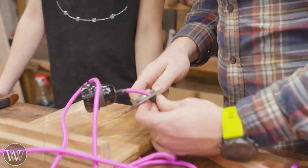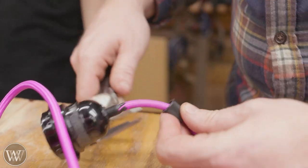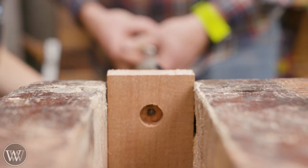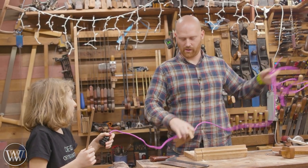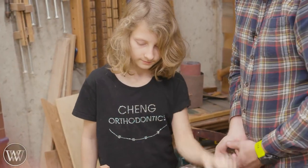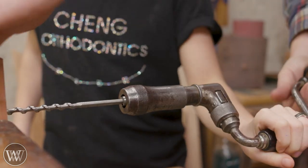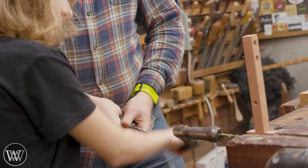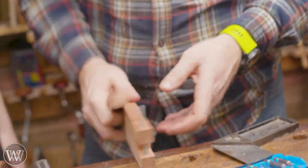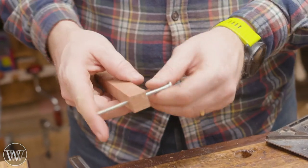You can see on this one we split a little — it's not as much of an issue here because we're going to be putting the pins through it and we'd like a little bit of force on there. We can ream those out and get them to the size we want. Speaking of pins, I have a little bit of three-eighths dowel on stock, so we're going to use that. The cord kit we came with — the cord can fit through, but the nut needs to screw onto the head, and there isn't enough threading on the head for the nut to come through. So we're going to drill a large hole for the nut to fit in, then a smaller hole for the head to fit in. You always drill the large hole first and the small hole second. We're also going to drill holes through the arm and through the vertical for the cord to go through, because we're actually going to have the cord weave through this whole structure.